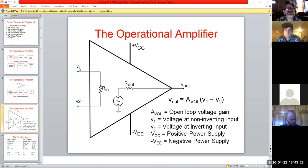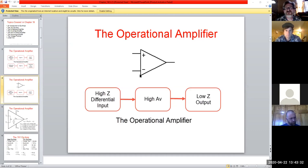Another thing to remember is the way our inputs deal with each other: E plus is always equal to and follows E minus. The voltage potential here is going to be the voltage potential there, but it follows. So if E plus equals and follows E minus, that means E minus is first, always and foremost, and then E plus is next, if that makes any sense. Another point to always remember is that the input between these two has infinite impedance, ideally infinite, but in reality usually up into the megaohms. And then the gain formulas with these. Another thing to remember will be our current, where I plus is equal to I minus.